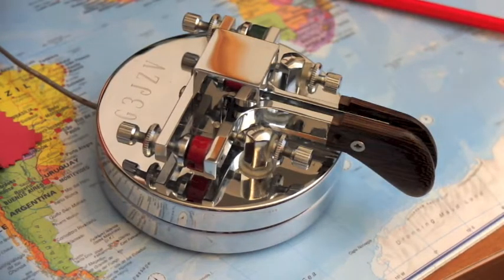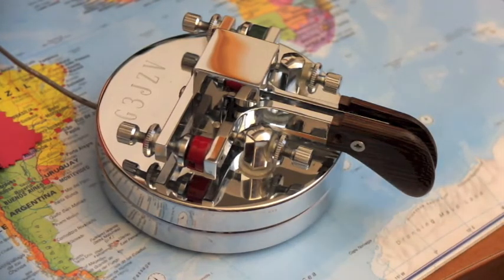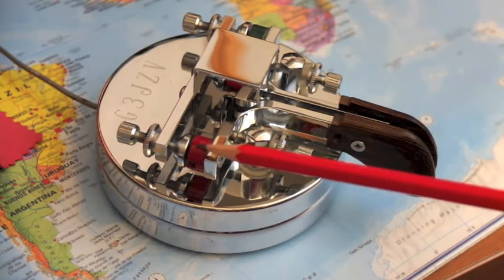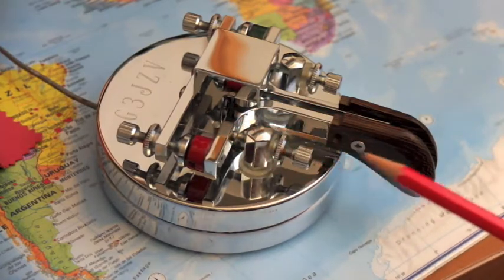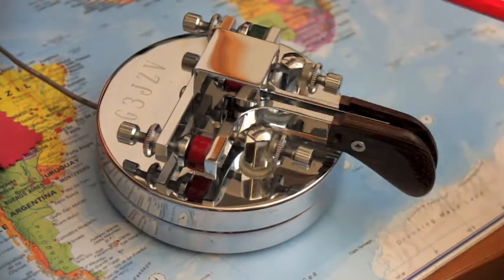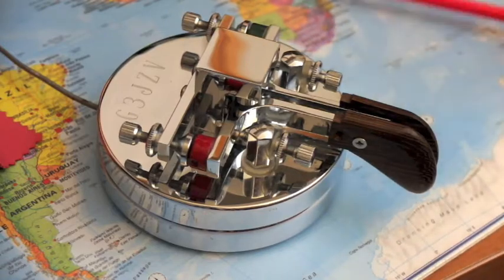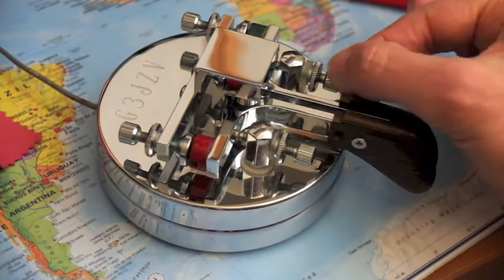This is a very interesting peculiarity because this key is very heavy. If you want to go a little bit faster with this kind of mechanical setup, maybe it is better to not use the iambic mode, because the magnets that tend to push back and call the arm toward them are also provoking some bouncing. If we slow the speed and take out the keyer, since we have a very long lever, we can widen the contacts more and use this as a sideswiper.